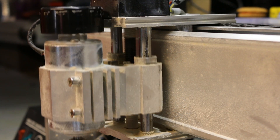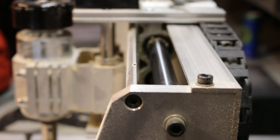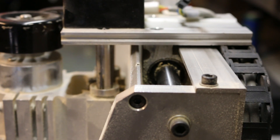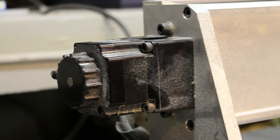The 3040 China CNC is what they say is good for hobbyists. I have mostly been using it for pine wood and soft wood. Although the speeds and feeds are slow so I don't break my engraving bits, it can handle it — you just have to make sure your cutting bits are sharp. The max cutting area is 29 centimeters by 39 centimeters.